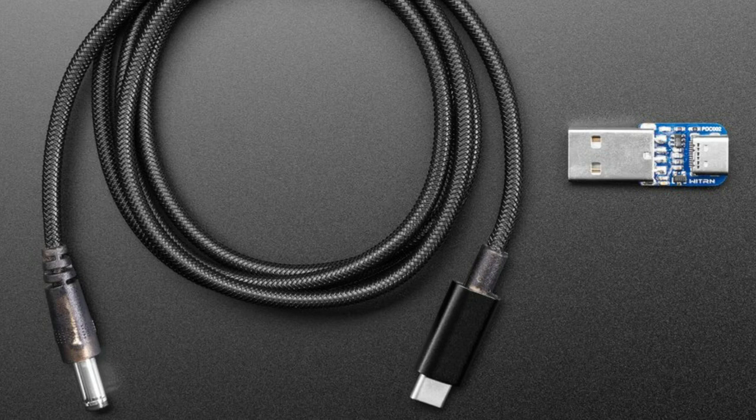But this cable comes with a little dongle. You see the dongle in the top right. You can program that. There's some Windows software that comes with it, and you can reprogram the power delivery requester chip to request different voltages. So you can have it be 5, 7, 9, 10, 12, 15, 18, and 20, I think.